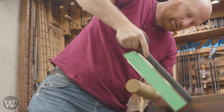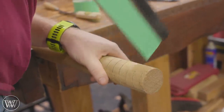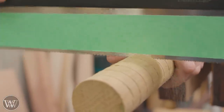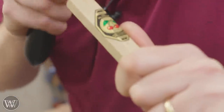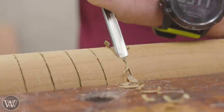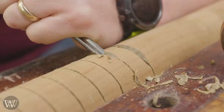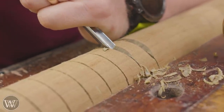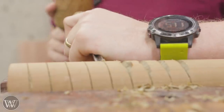Then we stop, rotate a third, and continue. A lot of this process is just rinse and repeat. It's pretty simple — you cut down to a depth and then you come in with a v-tool and carve it out. There aren't a lot of steps to it, just the same thing over and over again. Now because this is going to be a double thread I should probably come back through and cut a groove in between, but I decided to try freehand carving it rather than following the groove on the second thread. So for this we're just going to use a v-tool and go in pretty deep, which means three or four passes all the way around. As you continue around you have to continually rotate so you're matching the new angle at every point. The threads right now are just going to have facets and that's okay. I'm going to go down until the wings of my v-tool are just touching on both sides, so I get an even depth measured by the v-tool in the groove.